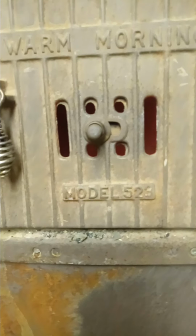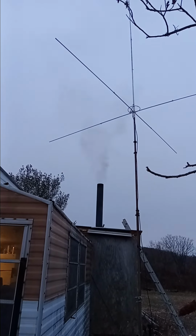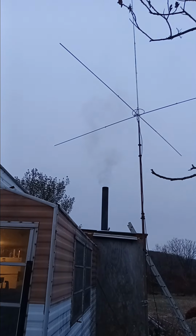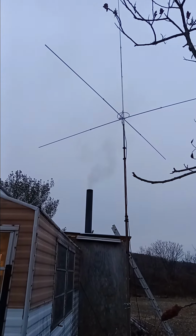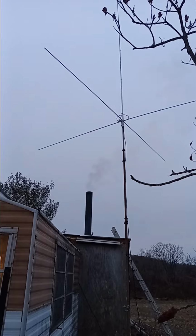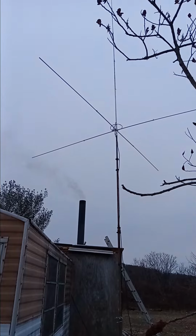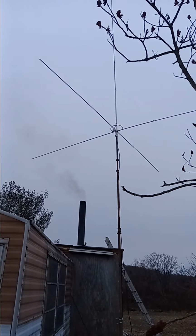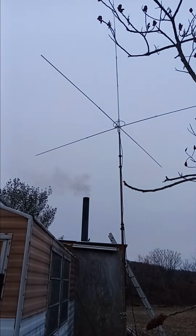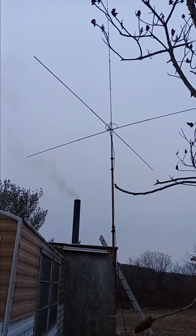Now I'm going to pause this and we're going to go right outside real fast. That's what's coming out of the stack with the bituminous. Yeah, it's a little smoky. Anthracite don't do that. But it ain't like what everybody portrays it as. And I'm telling you what, it smells like them black snakes on the 4th of July that you'd light, and from a little black pill would turn into a snake. That's what that smells like when you give it the right amount of over-the-fire air. So you got to have a stove that can burn it.